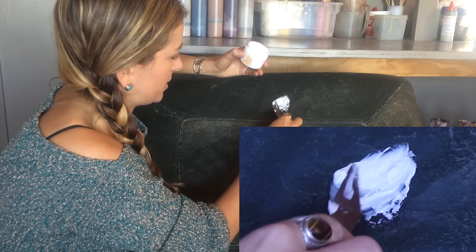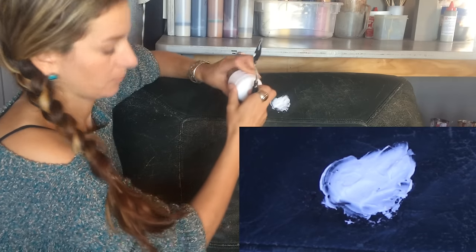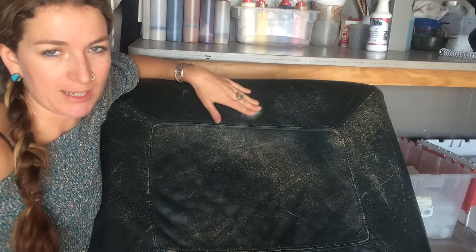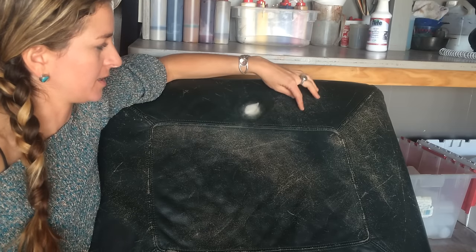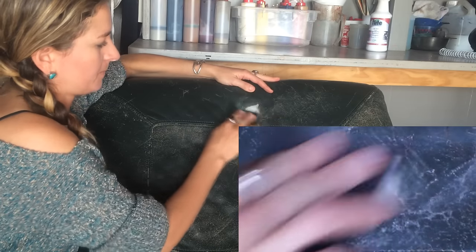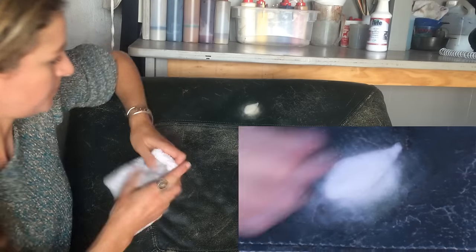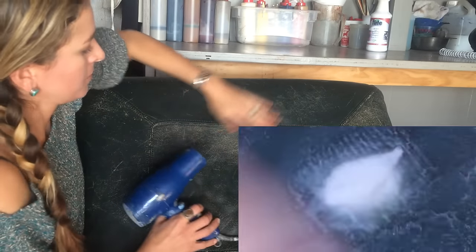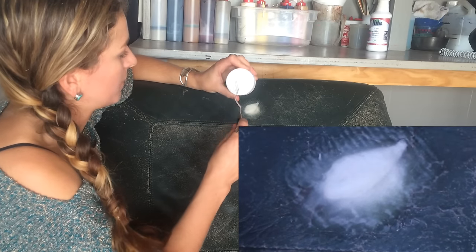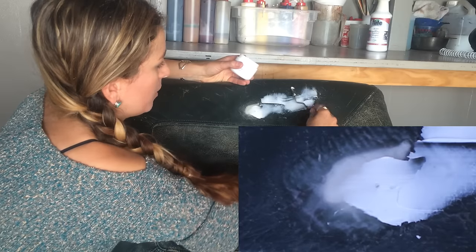I'm coming over more to this edge to deal with this ridge. I've done a couple more passes just to get a good fill. Now I'm ready to feather out into these areas that need just a little bit of minor fill and also texturizing. I'm going to do one more quick round of sanding just to rough it up, get off any little pimples, smooth it out. Wipe it with a damp rag, let it dry. If you do use a hair dryer, don't make it too hot before applying more compound. I'm going to get pretty aggressive here and go big up into these little regions — the vast majority of it I will remove with my business card and feather out.